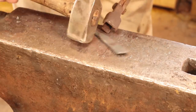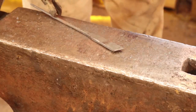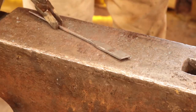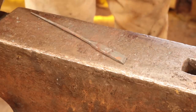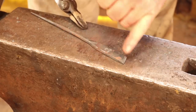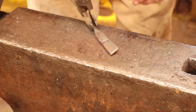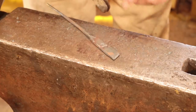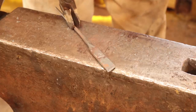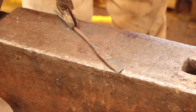That's pretty much all of the forging steps for our marking knife. It's got a blade section and an awl section, a nice little transition that will clean up a little bit with a file. Got my touch mark. The bevel is established but not super thin — you don't want to go too thin because you can decarburize some of this and then have trouble with it holding an edge. I'm going to heat that up one more time to a dull red, then set it aside and let it normalize.